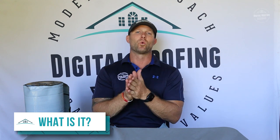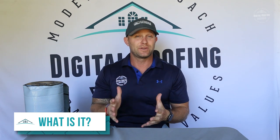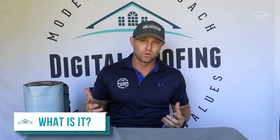All right, so what exactly is ice and water shield? Well, we're gonna go ahead and define that, and we're gonna keep it pretty simple. We're gonna call it a self-adhering, waterproofing roofing underlayment that's used to prevent ice dams and wind-driven rain. Now, when I show you the different spots where you actually install this, you'll understand how it helps prevent ice dams and the wind-driven rain that can cause damage on your roof.